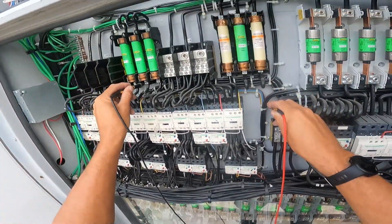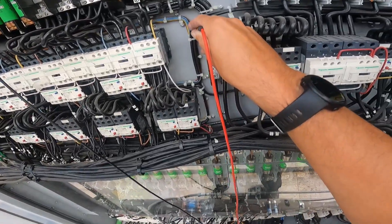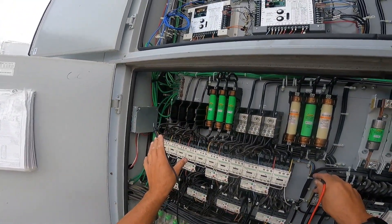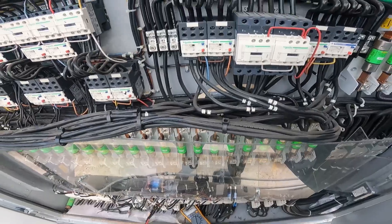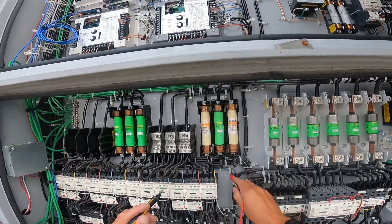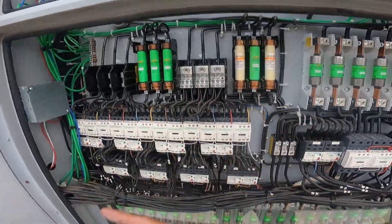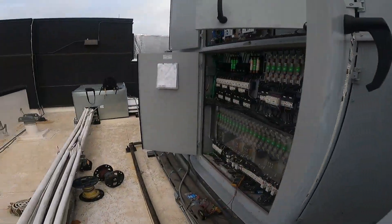Okay, I still have two spares. There's a chance we have a bad motor in here somewhere causing these — actually it'd be two bad motors, because this side services eight condenser fan motors and the other side services the other eight. I didn't even mark them — I think the center one, yes — and both outsides are good. Okay, center and basically all the green ones. Let's kill the voltage and knock these things out. Maybe I should get some Channies first — a little bit of hydration.